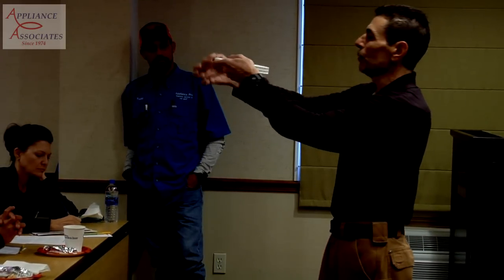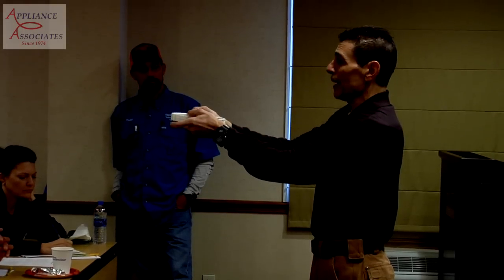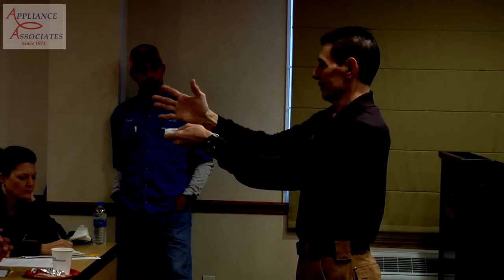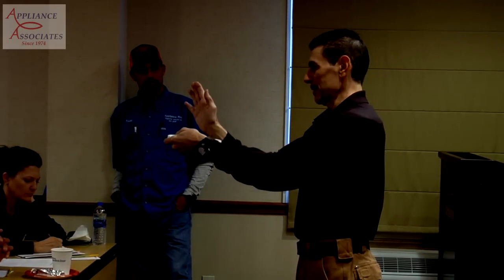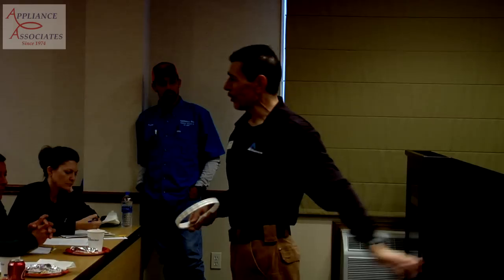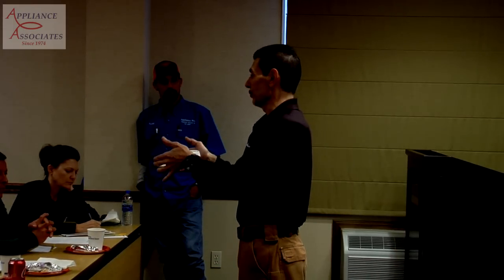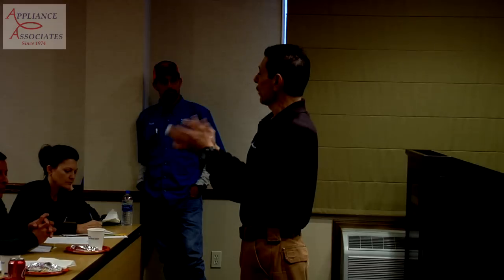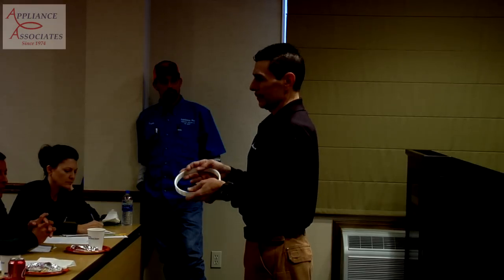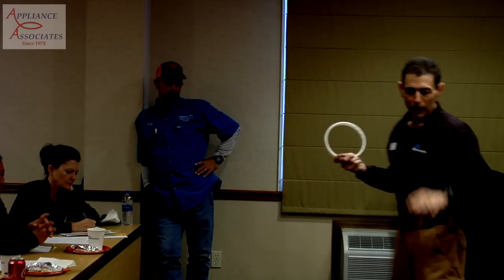When this cracks on one side, it starts to spread. When it spreads, you're now going to have a leaner. Okay, the whole tub will lean. You may get it in the house where you're installing it, start it up and run it. When it gets to spin, this thing's really going to open up and you'll know the direction it's going. Usually the direction it goes is where the split is. Okay? I'll pass this around, but I also want to speak to how this stuff works.